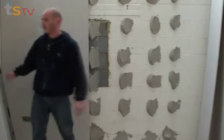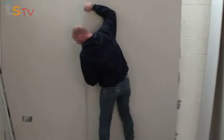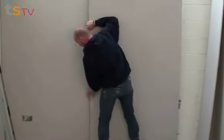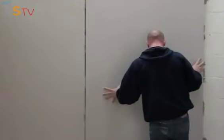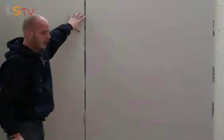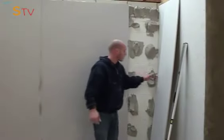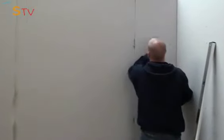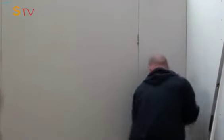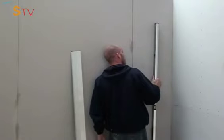That's our second board in now. Just tap it in place. As you can see our floor must be a bit uneven, so I'm going to pack it up a little bit to allow for that. Now it's time to put our last board in — same as before, tap it in. Now we can check our level, and that's it.